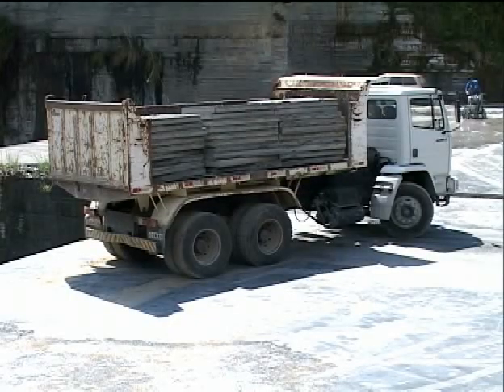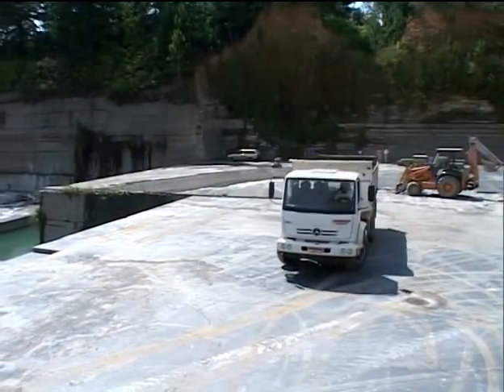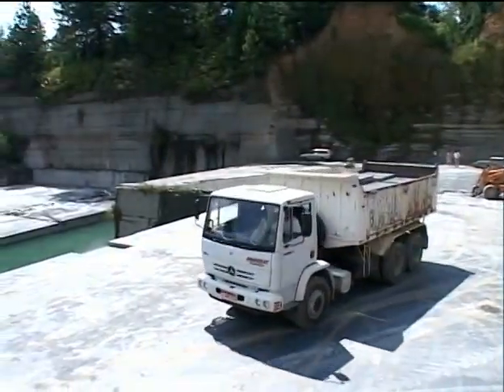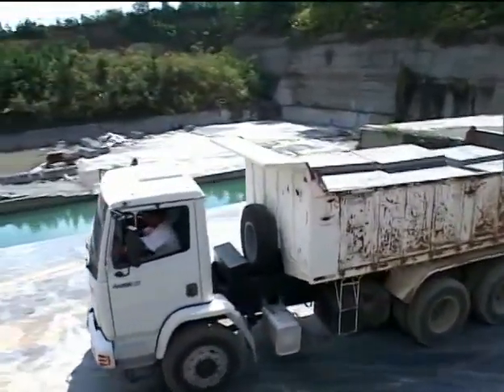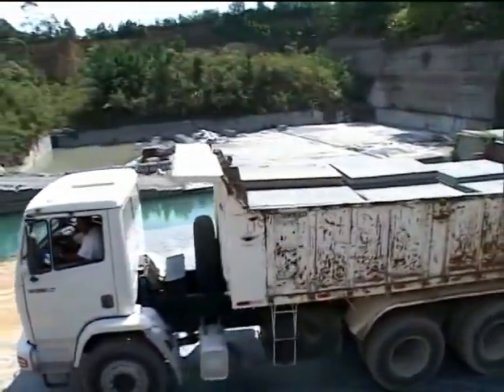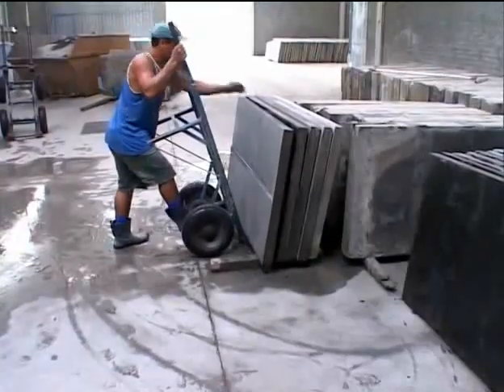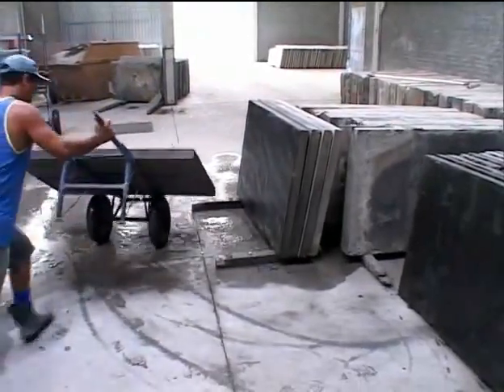When the loader reaches a full truck load of Brunswick-quality slate, the truck is sent to a nearby factory for further processing. After unloading, the slate is inspected again at the manufacturing facility to check for any visible defects. At this point, since each piece from the mine can be anywhere from 4 inches to 16 inches thick, the slate needs to be sliced or cleaved into thinner pieces. After the slate is separated, it is then sent to the first of many stages of surfacing processes.